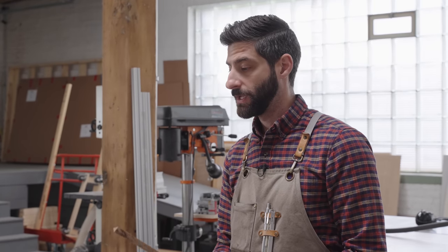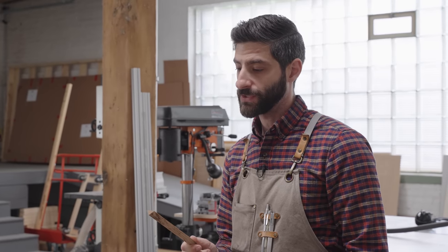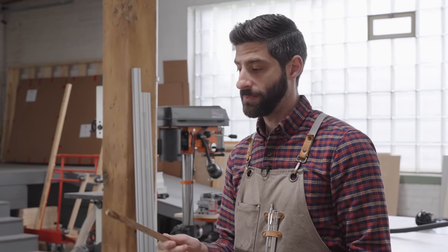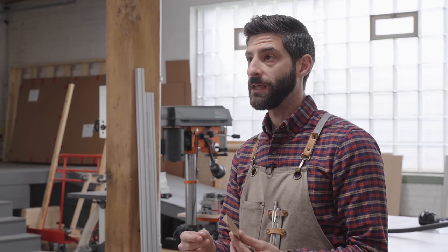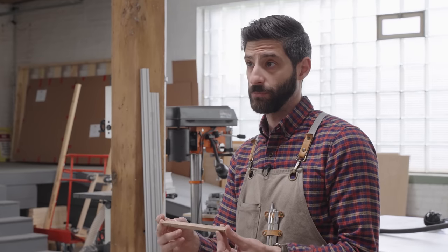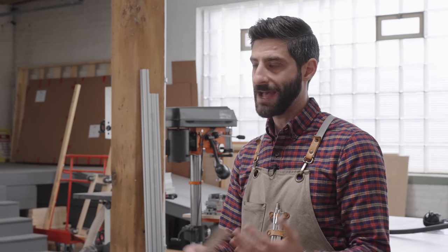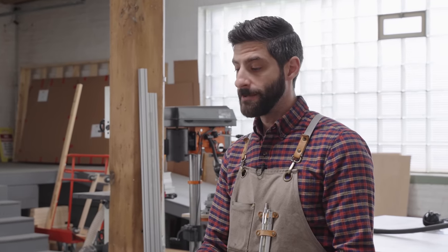So we're going to be using a two-part epoxy. It's controversial because it's not reversible, but we are going to be using an epoxy specifically designed for wood — it has the same mass and density as wood, and when dry it tools and carves like wood. It's used a lot in conservation of furniture and wooden artifacts. Even if we used hide glue there would be no way to simply reverse it; it would have to be mechanically removed physically. This is a common practice, and I consulted the Getty Conservation's tome on panel painting conservation — this approach is understood to be acceptable when there is no other avenue.